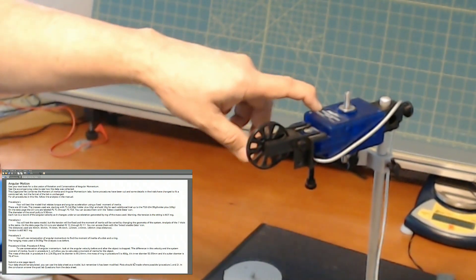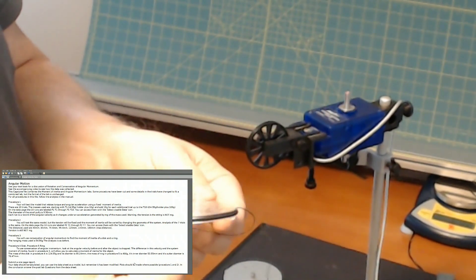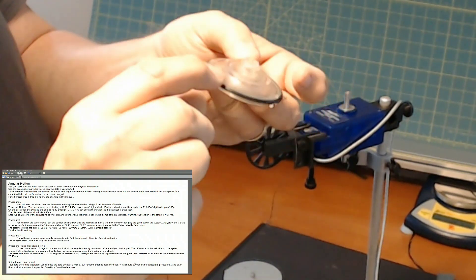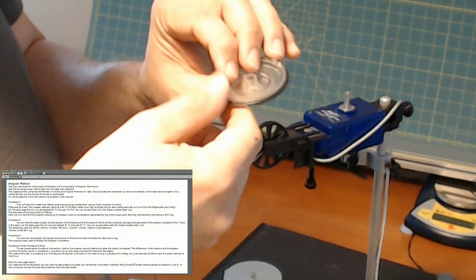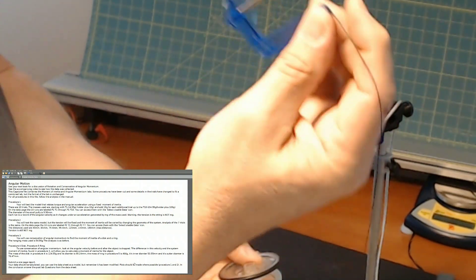This is our device. This is the sensor that collects everything — it's a PASCO rotary motion sensor. It's designed so that this little axle spins and there's a device inside that measures that spin. In this case we'll calculate the angular velocity of whatever we have sitting here. In order to hold something and generate torque we need a pulley. This pulley has three different sizes. We're going to use the smaller pulley for this lab exclusively. I also have a piece of thread, a mass holder, and a set of masses to work with.